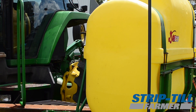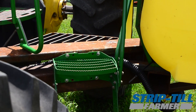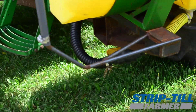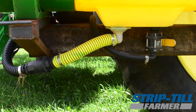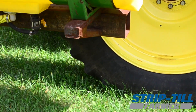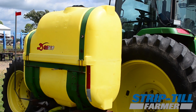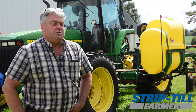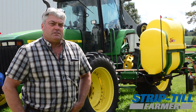Behind me here is a new rendition just this year — we made a little different nitrogen side-dress bar, moved the tanks from the bar itself onto the tractor. So we had to come up with a way to work some side-dressing saddle tank mounts on our tractor while still being able to keep the front wheel assist tires at a 120-inch spacing, which we enjoy for stability and our ability to get through wetter areas. It holds better on the hills, but there's just no room for tanks, so they had to be alongside us.